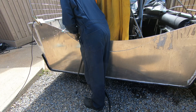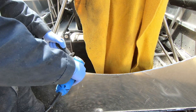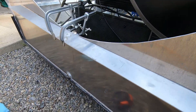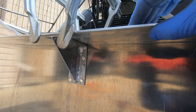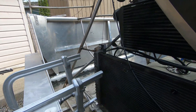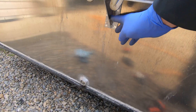Let's get started. This is the piece that will curve up - I'll weld this on, just taking it incrementally. I made this piece basically just to hold it - it'll be for strength when it's up there permanently, but also because it was hard to clamp without it. This is riveted to the transom. You can see the rivets on the back side there. I'm going to weld it all the way along here coming up, and then I'll probably build a couple more of these as well just for extra support.